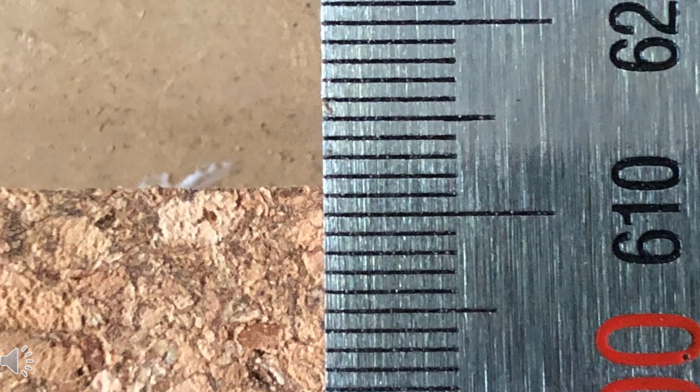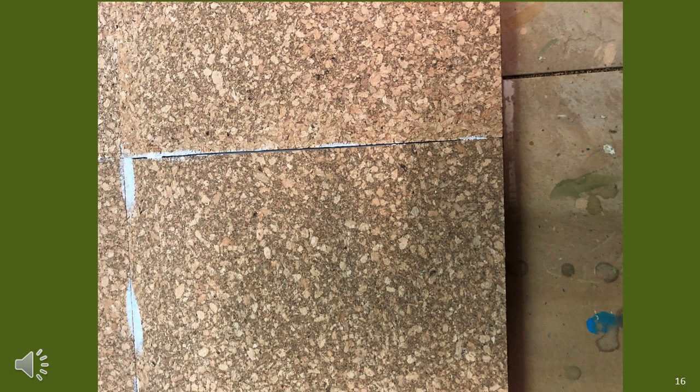The next thing you need to check is to ensure the size of the new cork tile is correct. It should be a 61 centimetre square if using 12-inch tiles, that's US measure tile. In this case, it's 1.5 mm too wide in one axis, which was an error on my part, which I had to resolve. While undertaking this project, I discovered the tiles are not all identically sized, which means to line up the outer edge correctly, you end up with a gap. This is unavoidable. I have no idea why the tiles vary so much in size, but they do.